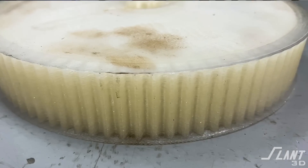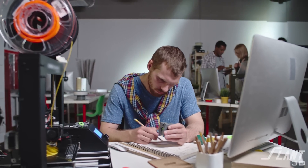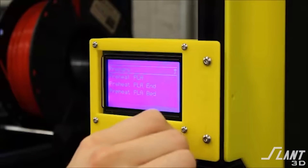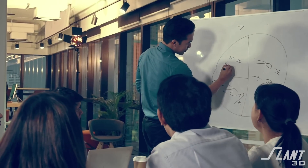So what did we do? We went ahead and, like good little engineers, we 3D printed it. That's all fine and dandy — everybody knows you can copy and 3D print a part — but the value of that is kind of lost on folks. Many people say 'we can 3D print that ourselves, we've got a printer in the office,' but the cost of that print is not just the cost of material. The material cost is trivial. It's all the time: having an engineer redesign and model the pulley costs $150-$200 per hour, running the printer takes time, and convincing everybody the plastic pulley is okay takes a lot of time. So the cost is not zero.